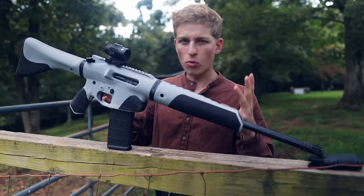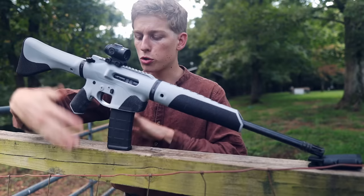It's more complicated if you watch the stream, but I actually used that technique on the upper and lower receiver, and it made it so much easier to design the upper and lower all streamlined and blended together like this, and then cut them apart afterwards using a surface, and then I used the surface to make the split line.